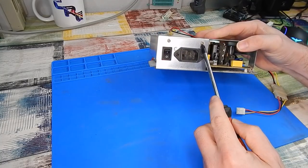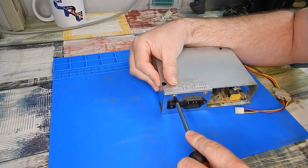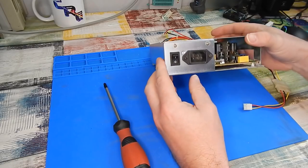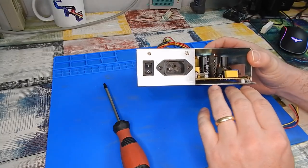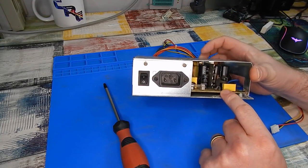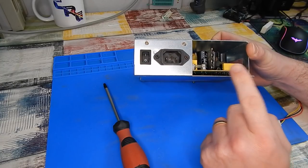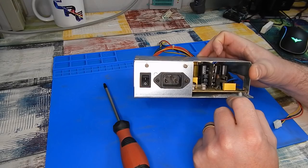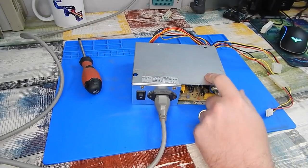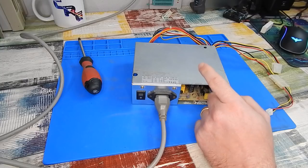Having a look in here, that corrosion is limited to that metal bit there - it is not up on the power supply itself. Just on the off chance this is putting out crazy voltages, let's just use an IDE hard drive. It powered on there. Five point two volts - maybe a little high but not concerning. What about twelve? Eleven point seven-ish. Yeah, not too bad. We should've checked negative twelve as well - that's fine too.